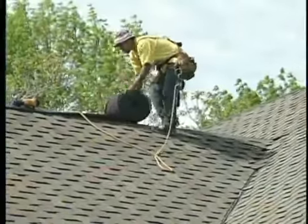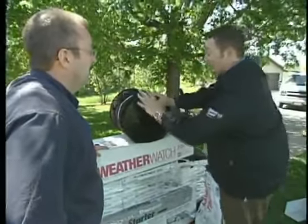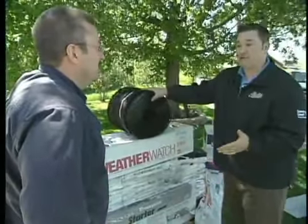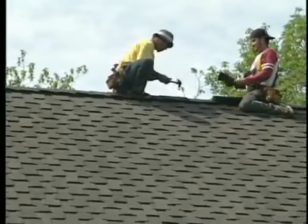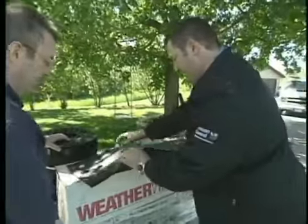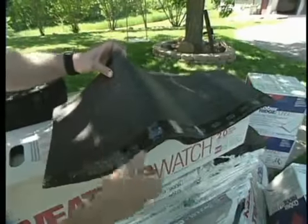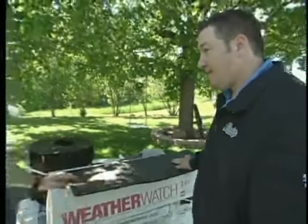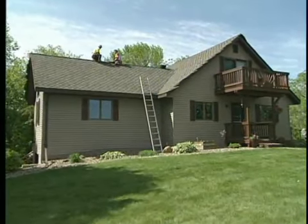These actually come in rolls that go over the entire ridge, nailed in certain spots, so you're not shutting off ventilation. It has a snow filter, which is very important in Minnesota and Wisconsin — snow is going to get on your roof and you want to make sure it can't get into your attic. This system has an excellent rating to ensure air can get out of the attic quickly. When that's all done, we use the Timbertex Ridge Cap. You can see there are perforations along the back — they're pre-cut to the perfect size, so there's no variation and the contractor doesn't even have to measure. The trick is to install them in the opposite direction of the prevailing winds, since the ridge cap is the highest and most susceptible point to wind damage — so when the wind comes, it's going against the grain and won't peel it up.